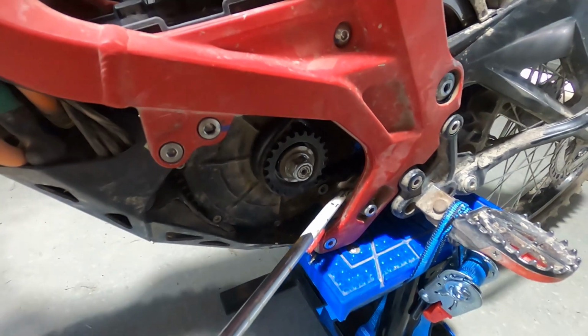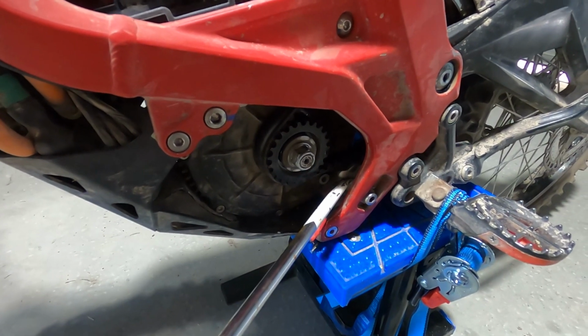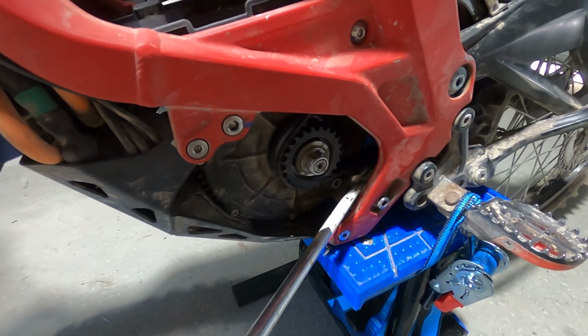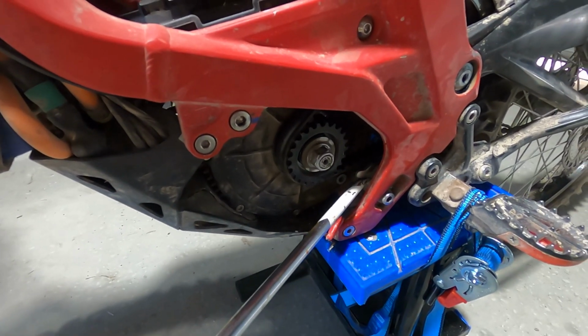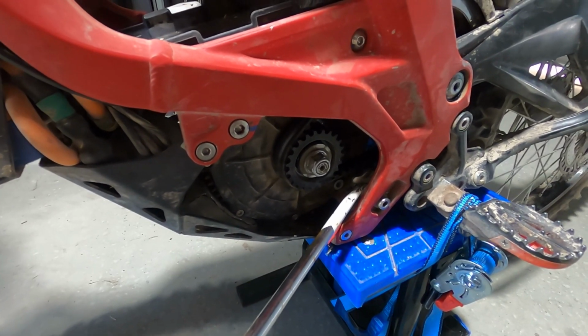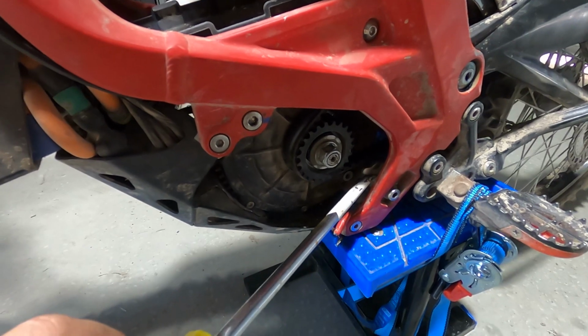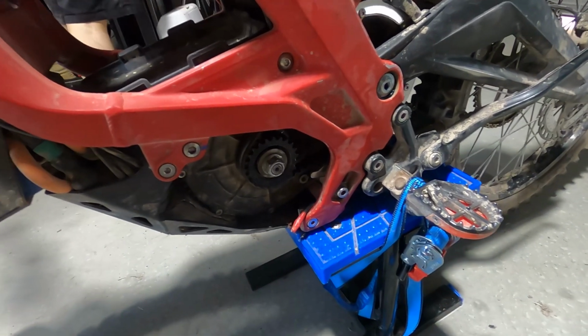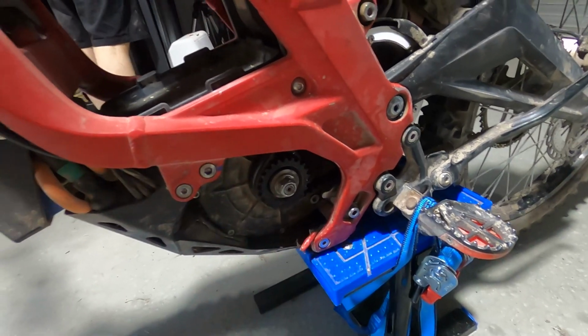And Truett's going to go for a ride now, just to test it. We'll check the tension. We won't put the cover back on yet. Probably check it over 10 minutes' worth of ride, see what it's like, and then see if you need to retension or loosen it to suit if it's screaming its head off. I mean, you'll know, you can hear it. And then probably in another couple of weeks we'll check the tension again, and that's what you do with the belt.